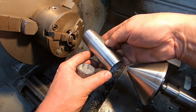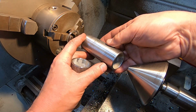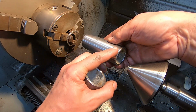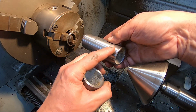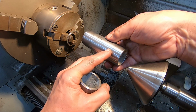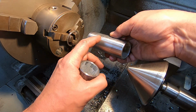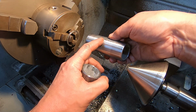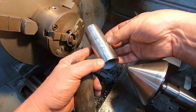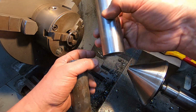Okay, so I'm making the rollers. Now when a flat belt runs on something like this, it's a good idea apparently to have a slight doming on it to help the belt centre on the roller. And I looked at my belt sander, I could see that was the case, and I scaled off that and figured I needed about 1/2 millimetre high in the middle. So I've done this one using a setup that seemed to work, so I'll show you how that was.